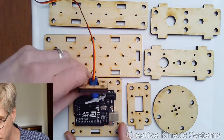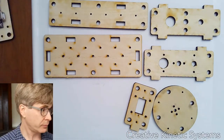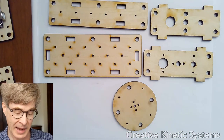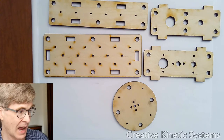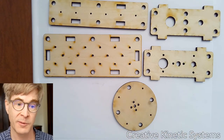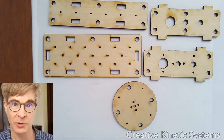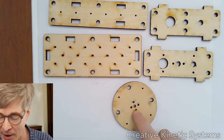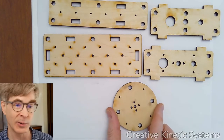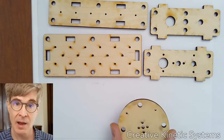Those are some speculative parts for servos and the Arduino. The disc part has a hole pattern in the center designed to fit a hub that will fit onto the four millimeter shaft of the small gear motors. Those Pololu hubs are very useful for coupling the small diameter metal shaft out to a larger diameter so that a wooden part can attach without breaking on the shaft. The center hole pattern fits both the shaft and screws that fit into the hub. There are also speculative outer holes — it could be a wheel, a rotating part mount, or the core for a link drive.